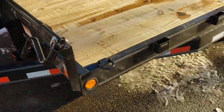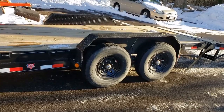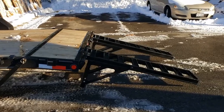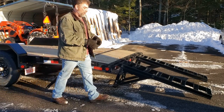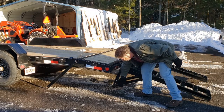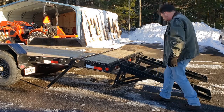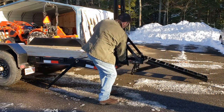So that's the walk around on the trailer. Like I said, we bought it mainly for the tractor and also so we can put logs on it. The tractor went up there so easy — we took it out for a 30-mile run and it just pulls awesome. The brakes work awesome. Right now I'm going to show you those nice flip-up ramps and how they go up so easy. I do really like these ramps — they worked very well for bringing the tractor up. I like the spring assist. They've also got this adjustable piece down here that'll sit on the ground. What that's really good for is when you're putting something heavy on the trailer and pushing down, it's not going to lift the back of the truck up because the weight's going to be down there. They lift up very easily because of the spring assist — they slide in and out like that.